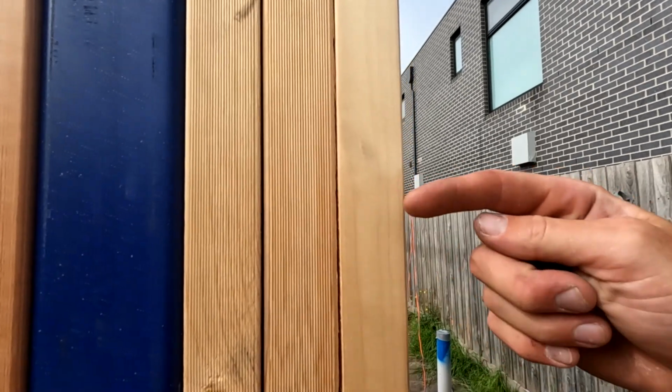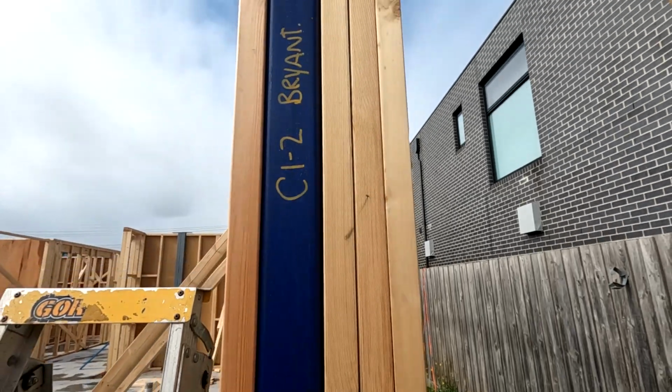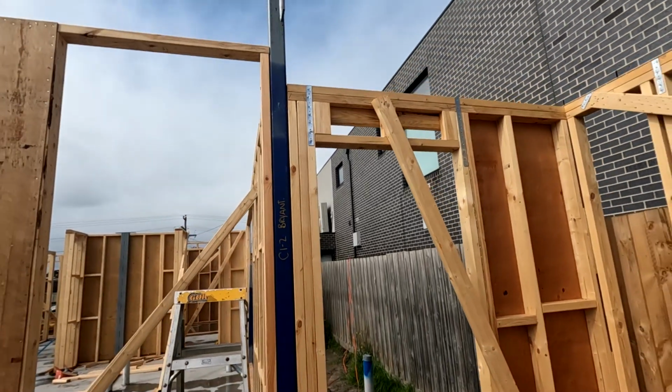If there were 2 studs, I might get the spade bit to take out like 20mm and then use an impact to put a bugle through there. Not with 3, and this is our load bearing stud too. And it's so dumb, that's why I hate doing steel afterwards.